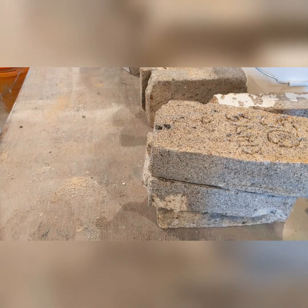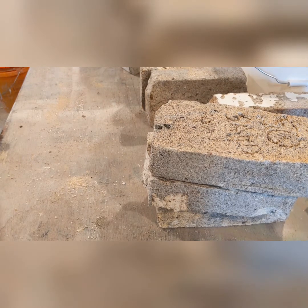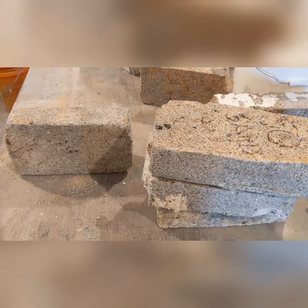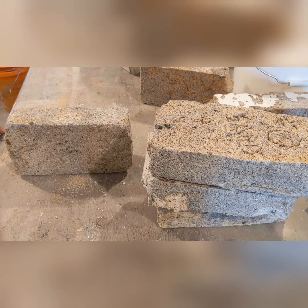I'm going to make probably between 40 and 60 of these bricks as my first production batch. I'm still making minor changes — mainly I was using masonry sand to make these bricks, but I see some small iron specks and impurities in that sand. So I'm deciding to switch out the masonry sand for plaster sand, which should be a purer variety and also a slightly finer grade. That's really the only change I'm making. I picked up some plaster sand the other day. I'll see you folks in just a bit when I have the clay mixing and brick making station set up outside.